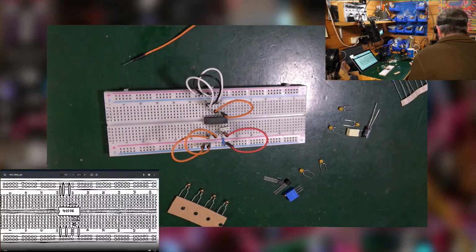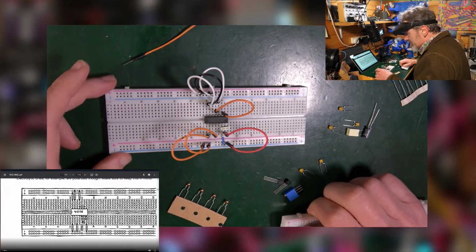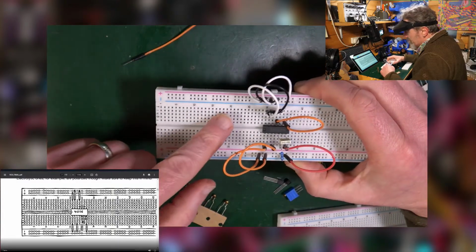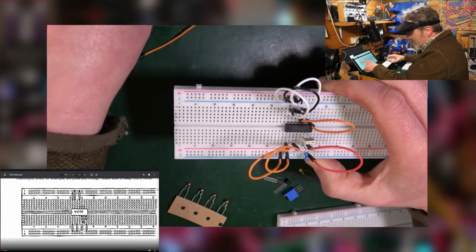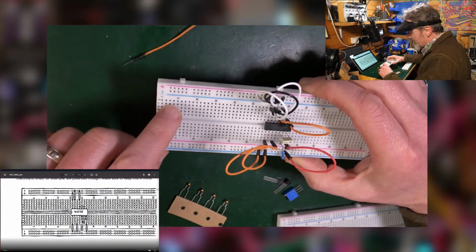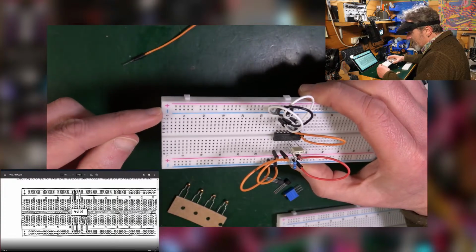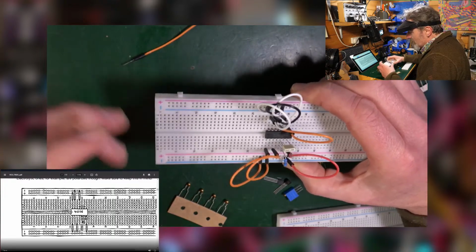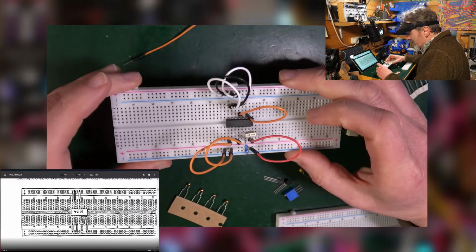That's interesting. See, it's a good job I was asking the right questions. I didn't know there was an orientation on a breadboard. And the interesting thing is that the numbers on here, see those numbers, 5, 10, 15, 20, are the same as what we see on here. So in respect of the numbers being written on the board, it's identical to the one on the screen. However, these positives and negatives are back to front. So what I was saying earlier about the resistor going into ground, not into positive, is absolutely right.